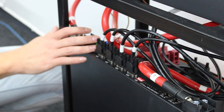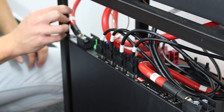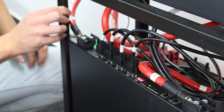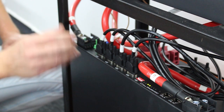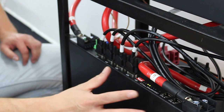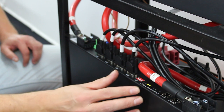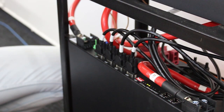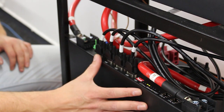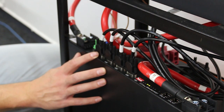Once the plug is in, switch on your DC breaker for the BMS. You will see the lights running through the start-up procedure. Please remember, all of our boxed BMSs will default at 50% value until the system has been put through a full cycle. After we have established everything has been connected correctly, please switch off the DC breaker.